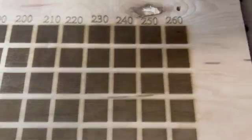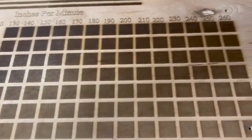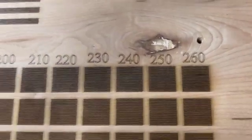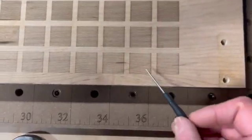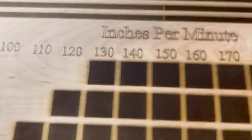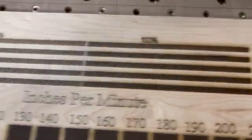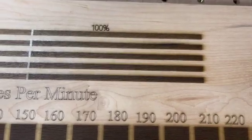I also realized that there's ramp up and ramp down speeds, so at the higher speeds you don't see a lot of variation. But you can see it gradually get darker. In the lighter settings there's a little difference, but it's a great matrix to utilize the power and speed. With the short span, I thought I'd go a little bit longer — 75% and 100% at 220 up to 260 — and there's a lot of difference, which is very clear to see.